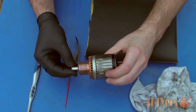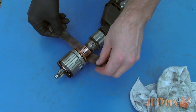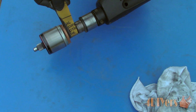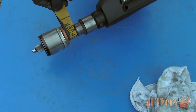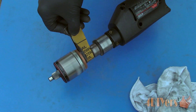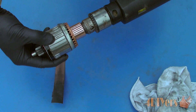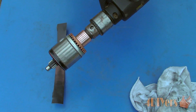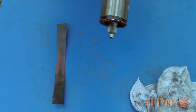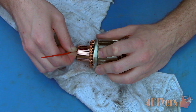As a better, more reliable method, use a drill. Not all armature shafts are the same size, so you may have an issue using a drill as some chucks do not open large enough. Have a piece of sandpaper the right width and long enough to pinch a couple inches away from the commutator. This will allow for a fairly uniform sanding, similar to using a lathe. Ensure the surface imperfections are removed. Any deep damage can be too much for sandpaper, so you'll need someone to recut the surface on a lathe.